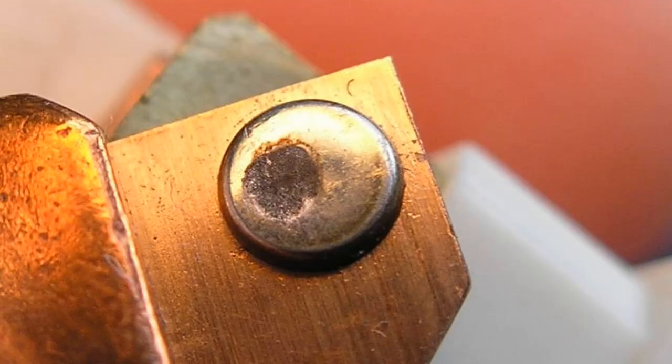These sorts of faults are nasty, and while they don't cause damage to your machine, they can ruin your work and you can absolutely tear your hair out trying to find one. These solenoids are usually turned on and off via a relay contact — that little spark you see erodes away the relay contact and causes pitting. The contact surface becomes smaller over time, and one of two things will happen: either the relay will no longer conduct and the solenoid will stop working, or the relay contacts will weld together and the solenoid will not stop working.